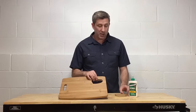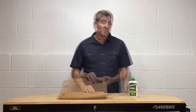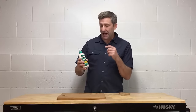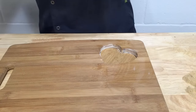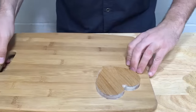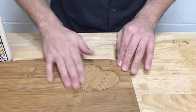Once you're sure you've got your shape to fit snug into your cutting board, the next step is to glue it in place. There's only one type of glue I suggest for this because it's FDA approved to be around food, and that is the Titebond 3. I kind of work it in from this side. With a lot of persistence I was able to get my plug in.